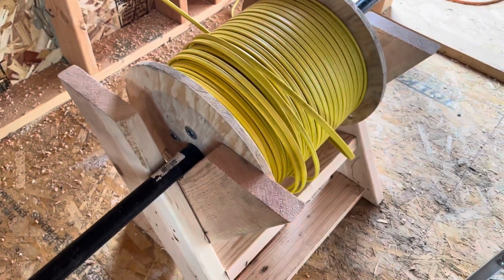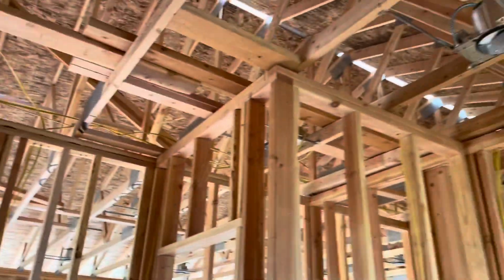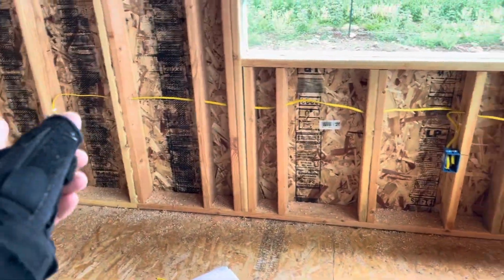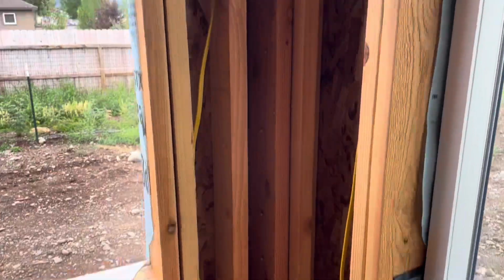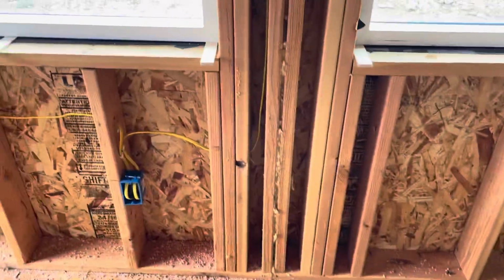We're reloaded. This one's wood, so it can't break. So it's pulling easy. Stringing the last 2 lines in this bedroom, and then I'll move out to the living room. Oh yeah. So we had to get creative with jumping around. I couldn't get around that corner for some reason with the layout of these and the length of my drill. So I jumped up, came down, came across, and then same thing here. It's just the studs stacked up weird.